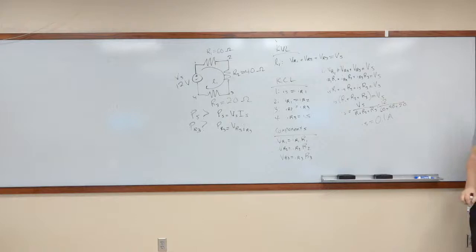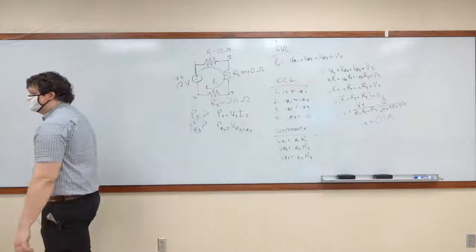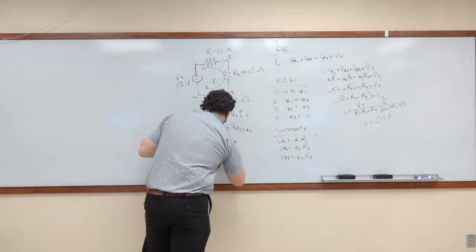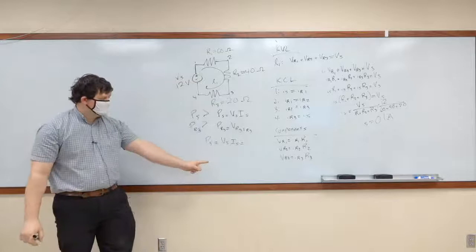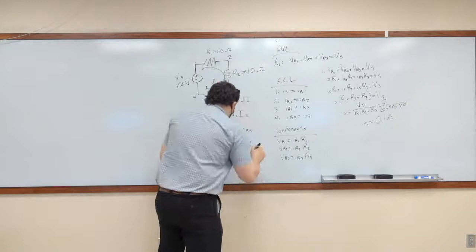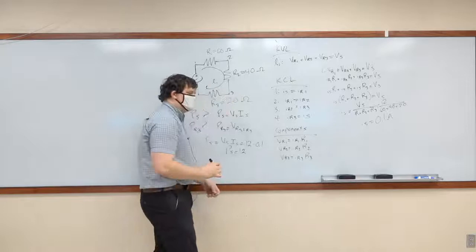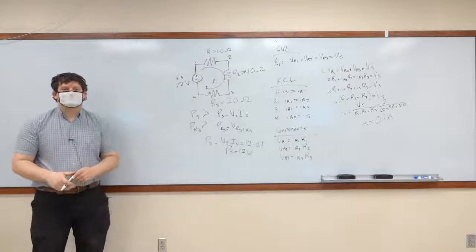We already know what VS is. Awesome. Solving. PS is equal to VS times IS. What's VS? 12. What is IS? 0.1 amp. So which means PS is equal to 1.2. And what is the unit? What? See, you get it.